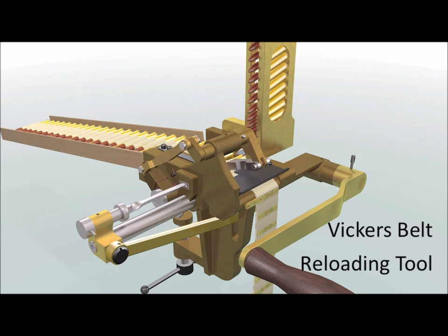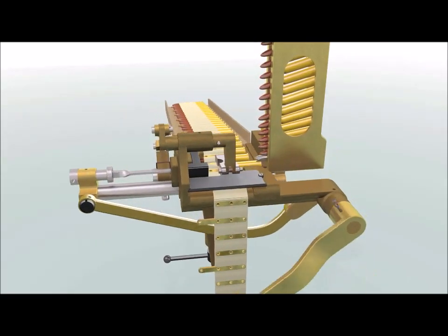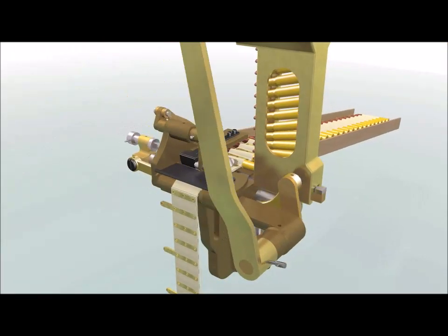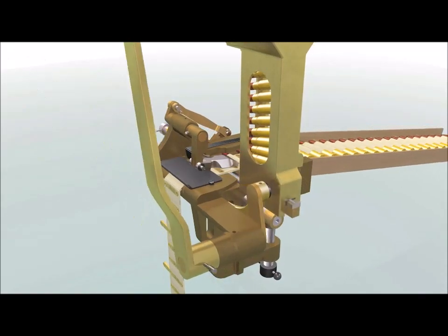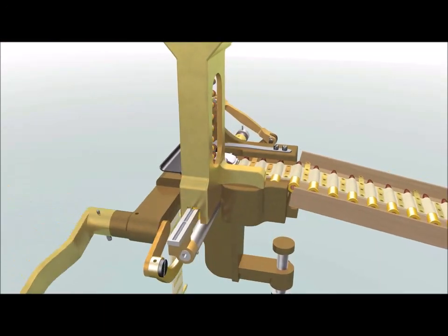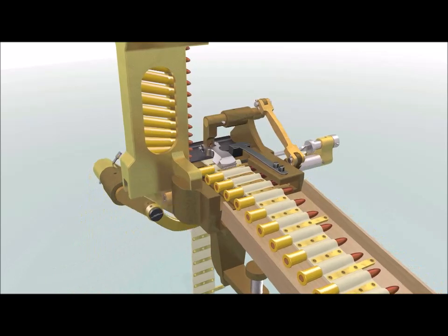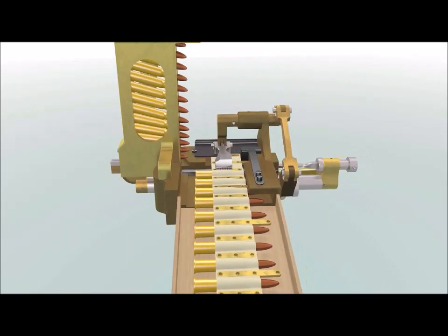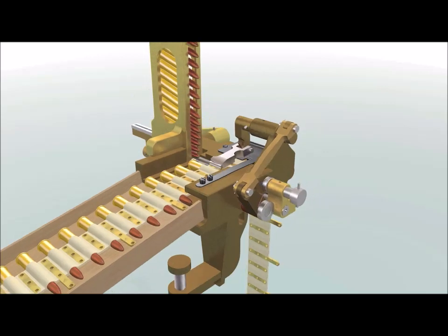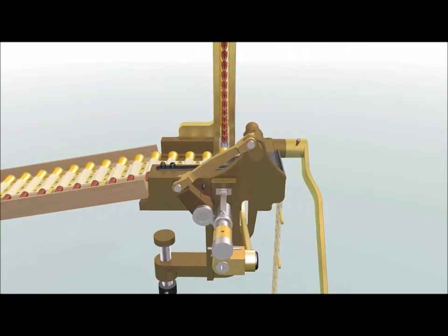Here's a useful animation of how the belt filling machine works, created by Rob Brassington, whose videos are quite well known on YouTube. His alias is at the end of this little clip, so you can go and look for more animations on how different machine guns and weapons — particularly torpedoes — work. This is really useful to understand the mechanism of the belt loader without my hands in the way. You can see here how that top pawl is dropping down and pushing that belt through, and just this simple action of rotating the handle moves the ammunition down through a feed tray — a sort of reverse tray — so that you've always got a little bit of gravity on that belt pulling it forward.